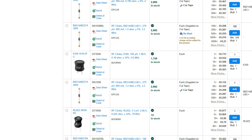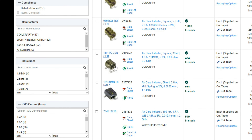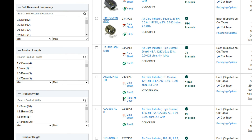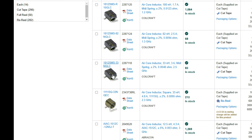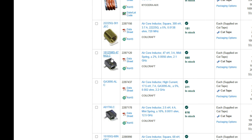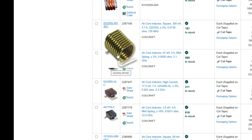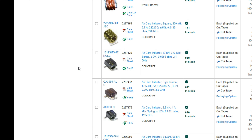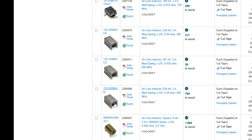Now we move on to air coil inductors. They are literally just bits of wire - bits of wire coiled. You can actually make these by wrapping wire around a pen, and some circuit designs do call for that. However if you're making a product you need them professionally made because it takes too long by hand. They come as bare coils or wrapped in plastic, so again you don't really know what they are. They can have single turns or they can be coupling coils with two sets of turns - which is basically a transformer.